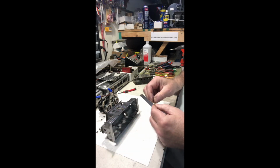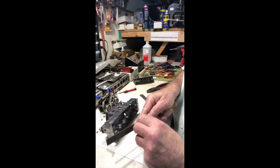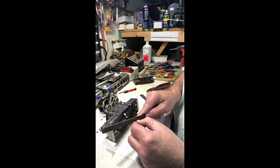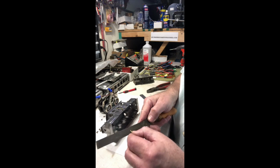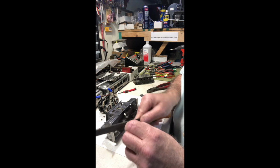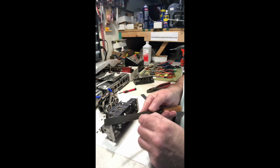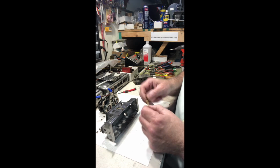Whenever I make railings, I don't like the little sharp end that it leaves. It'll usually catch up with you later somewhere. Somebody will get snagged on it. So I take my trusty file and rub these off, and I spin them a little bit, especially for these straight ones that are going to be visible all the time. You see both ends and you feel both ends. I like to round them off a little so you don't have any sharp edges to snag you. If you turn it in your fingers as you go back and forth on the file and give it a little rounded cone shape on the top, it makes a nice uniform look. This side is not so bad because it was the end of the rod, so there were really no burrs on it. But I'm just going to round it a little bit to take off any square edge. And there we go. These are simple ones to make.